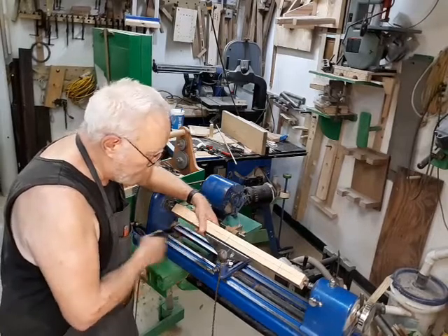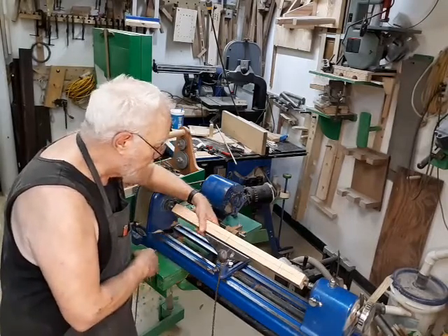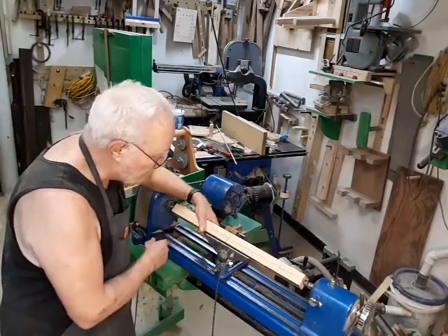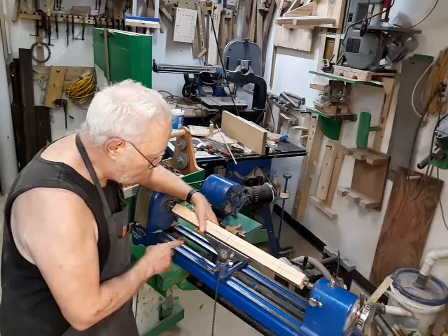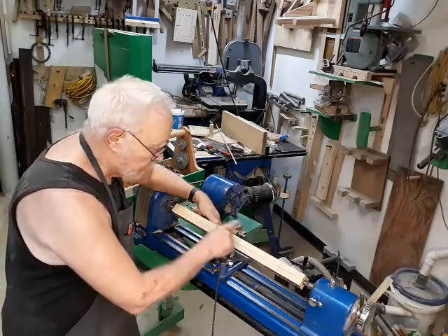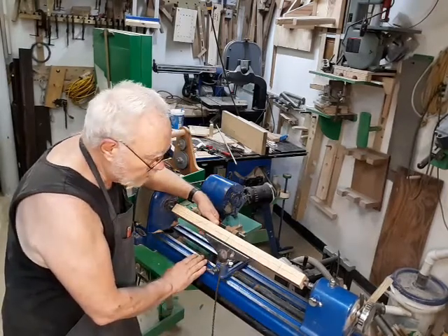Since this thing is going to be painted, I have no idea what the original stretcher looked like. It may have been a straight plain wooden dowel or it may have been turned with beads and stuff like that. I'm going to just see how the wood turns, and if it cuts nice and easy and smooth, I might make it a little fancier. But my goal is just to have something with a graceful curve to it when it comes down to the tenons.